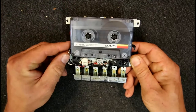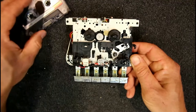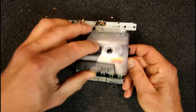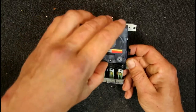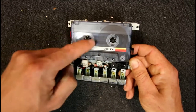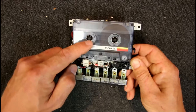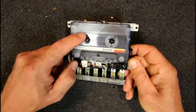The spool just spins freely — we'll call it a spool to differentiate it from the actual reel in the cassette. So the supply side can rotate at whatever speed the capstan pulls tape off it. Now the empty spool is about 22mm diameter, so its circumference — pi times that — is roughly 70mm or 7cm of tape per rotation.